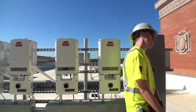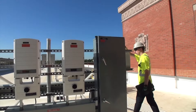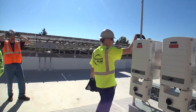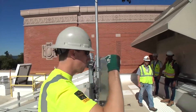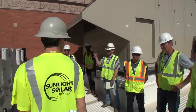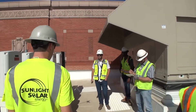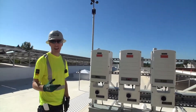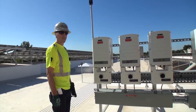What are the sensors inside the arrays up here coming out of this box? So there is wind speed and direction, and then two sensors here — ambient temperature and the pyranometer, which measures light. And then there is a module temperature sensor. You don't hear about module temp very often, but the hotter it gets, the less efficiently a solar panel operates. Just more metrics for us to view.